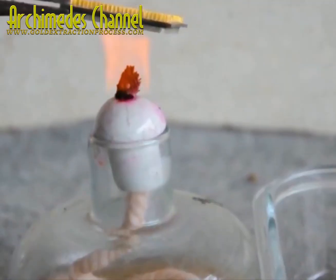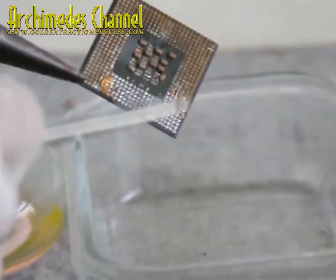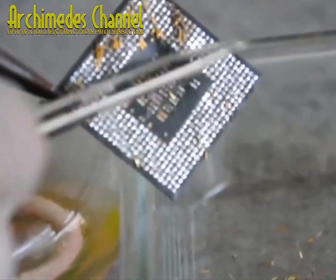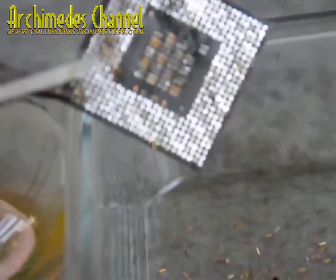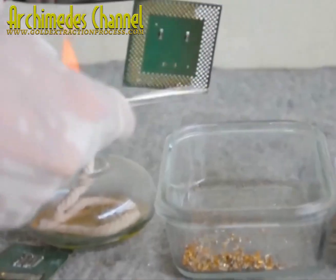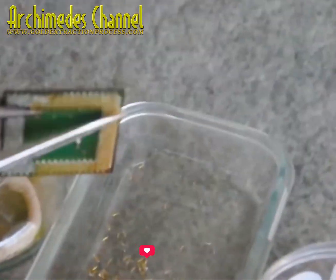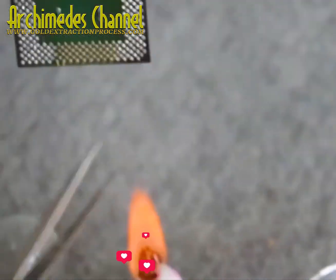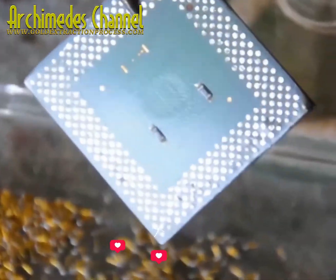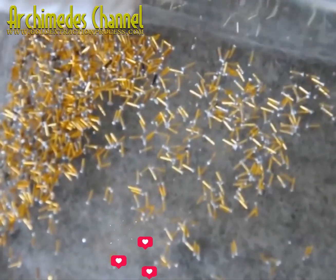There's a new trick: some metal in there is heated over a flame and the gold simply flakes off. Once it's all collected, it'll need to be broken down. Any remaining plastic can be removed, and it'll all then be filtered and processed through an aqua regia solution involving hydrochloric and nitric acids. Then the gold dust can slowly be collected, rinsed, heated, and purified.